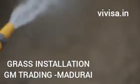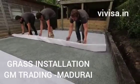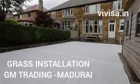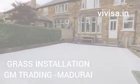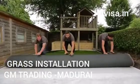Spray with water to keep the dust down and help the base material bind. To prevent weeds coming through, lay down a weed membrane over the entire area. Step 4, laying the grass. Roll out the grass, ensuring all sides overlap the area.